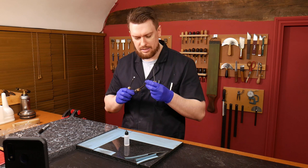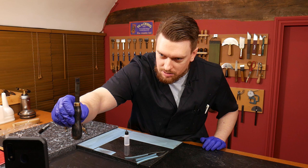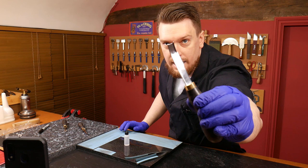But sometimes they come with milling marks. I'll try and hold it up to the camera so you can see what milling marks are. You can see those little circles — there's a bit that goes along there and it gouges out a channel, in this case 10 millimeters wide. But if it's worn or there's a bit of chatter, what you can get are those milling marks.